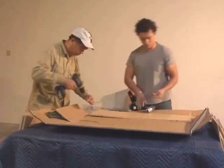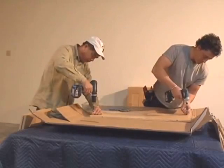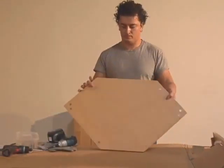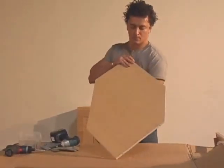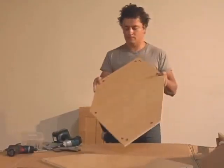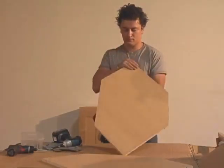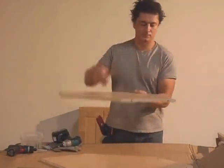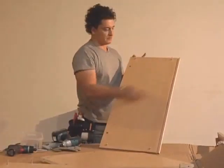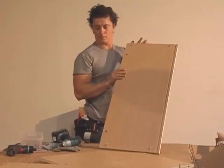Finish this step by putting set pins into back two. Now that all the set pins have been placed into the sides, it's time to start the assembly. Start the assembly with the cabinet top and the cabinet bottom. Note that back one and back two have a small groove for the final back section, back three.